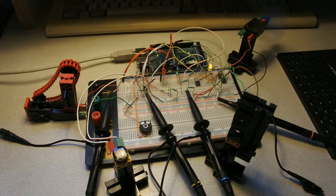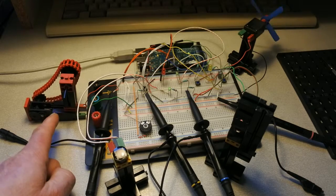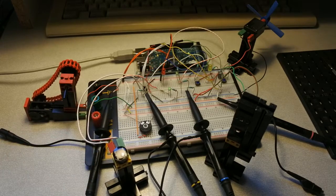Last time I had to change this circuit in the way that I had to replace both the motor and the potmeter, because this is a potmeter that is linear and not a balance potmeter of some kind. A balance potmeter is one that has a middle position, and from there you can have two directions in which you can have a 0 point, and in this case you have only one zero and the max, so this is way better.